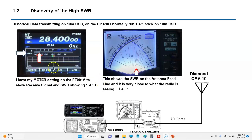Now here's the 10-meter upper sideband from six months ago. Perfect SWR, looking good — about 1.3, 1.4. Same thing here, looking good.